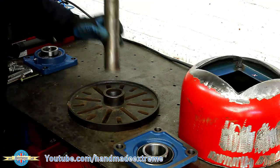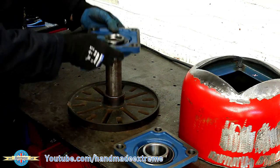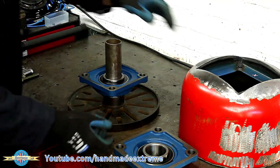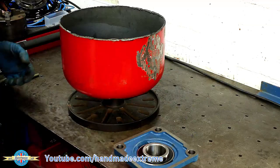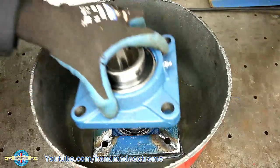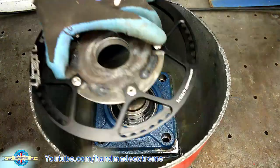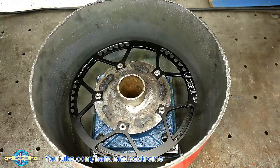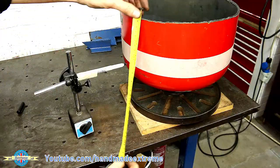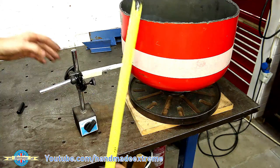Here's how it all goes together. The axle goes in there, then there will be an outer bearing, then the tank housing goes on, and then there's another bearing that goes on the inside — because these are semi self-aligning bearings, you need two of them back to back or at either end of the shaft. Then we've got our hub and chain ring which will provide the drive to the axle and in turn rotate the faceplate. Now I need to make a cutout in the side of the housing so that I can get drive from the motor through to the chain ring.